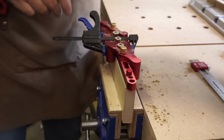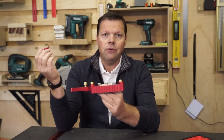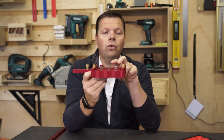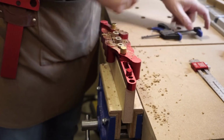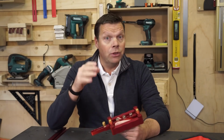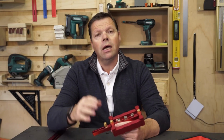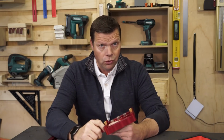And there are also doweling designs who do not have this opportunity, and then you have to put your pin in the first bush. So you only got 2 bushes left to drill your holes. So for this purpose, this doweling jig is perfectly designed. But that said, if you have to make a large number of holes on the edge of a piece of wood, I would consider doing it with a pillar drill machine because that gives more consistent results.